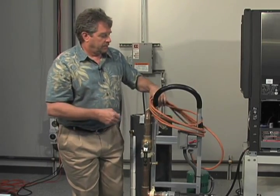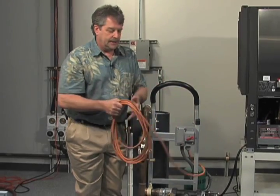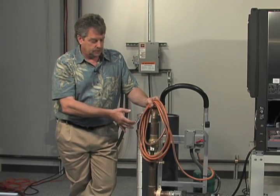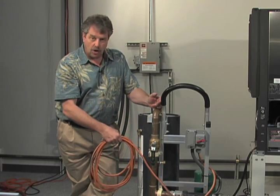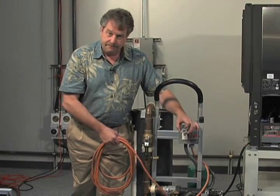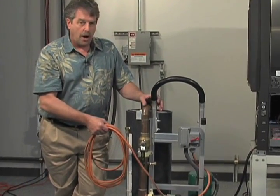We also want to recommend that you put in a heavy gauge wire, typically a number 12 wire. Okay, molded plug, grounded. This one's probably about 20 to 25 feet. You don't want to get them terribly long because you start to have voltage and amperage drop. We have a ground fault interrupted outlet that is also offering us protection with our watertight switch.